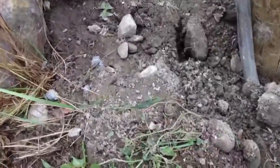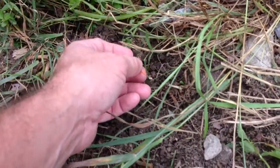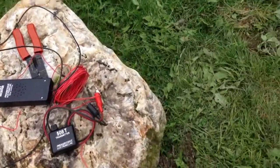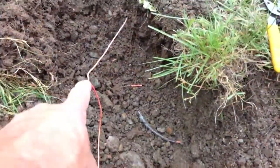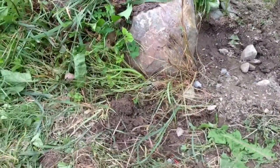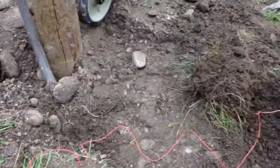Which stops. So we took the end of the dog line and hooked it up, and it didn't work. Tested it out, didn't work again. So we dug up a few more inches, thinking we had possibly nicked the line, then replaced another whole section of it, and kept going — and it still wasn't working. So I got the wire testing tools out and it said the wire was over here, under this pile of dirt. And it actually was. Because this is the real wire, and it was actually hidden in this piece of tape. Couldn't see it in there. So we had hooked it up to one of the old fences that, by accident, used to go around the edge of the pasture, which isn't connected up anymore. And that's why it wasn't working when we ring-tested it.